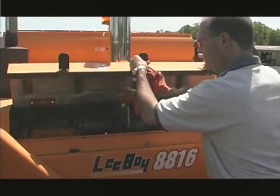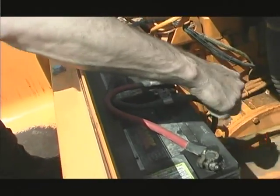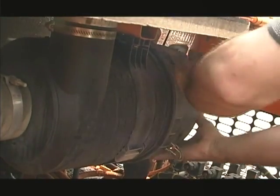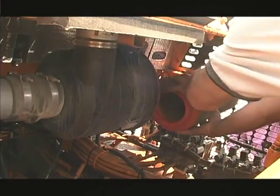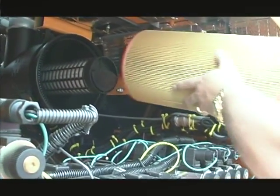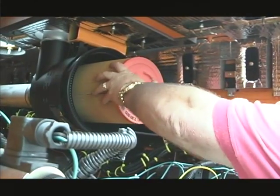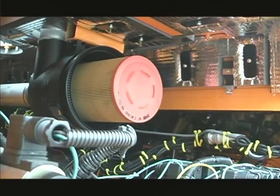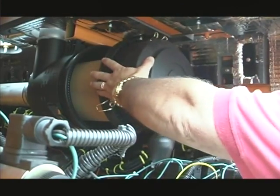Open the battery compartment and check the battery cables to make sure they are well connected and free of corrosion. Check the air cleaner by removing the cover and removing the primary and secondary filters. Replacing dirty filter elements is an important maintenance step because even a small amount of dirt can quickly cause engine wear. The filter should be replaced every 250 hours. After checking or replacement, replace the filter cover.